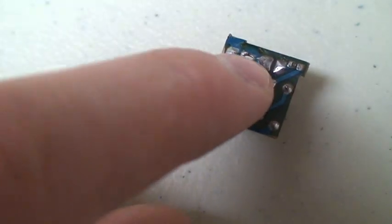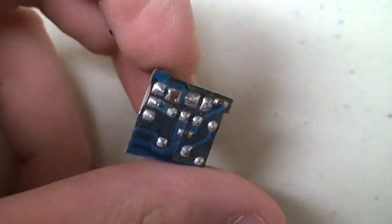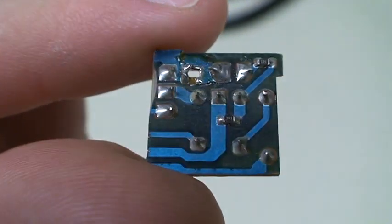The 2 there are LEDs. That's a resistor. And that's a little slot where a piece of metal connects to the circuit board, but you're going to put wires in there. So make sure that you take some solder out of that hole to keep it open. As you can see, there's nothing in it.